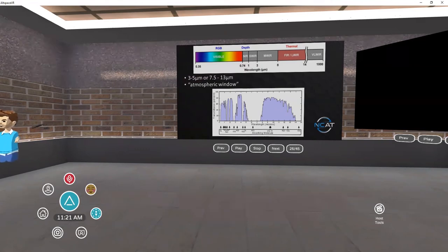When we talk about cameras used for agriculture and conservation, we use near IR or the red edge very often for crop studies — to understand how those crops are working, whether they're absorbing light as they should, whether they're healthy. When we move into mid wave and long wave IR, long wave is where most of our thermal is done. Mid wave we use for imaging around optical gas detection. Most thermal cameras that work in long wave are uncooled, which makes them cheaper than their cooled counterparts, but you don't necessarily get as accurate readings.